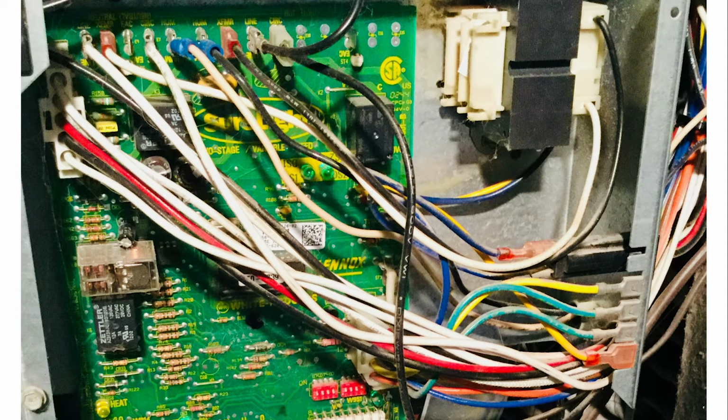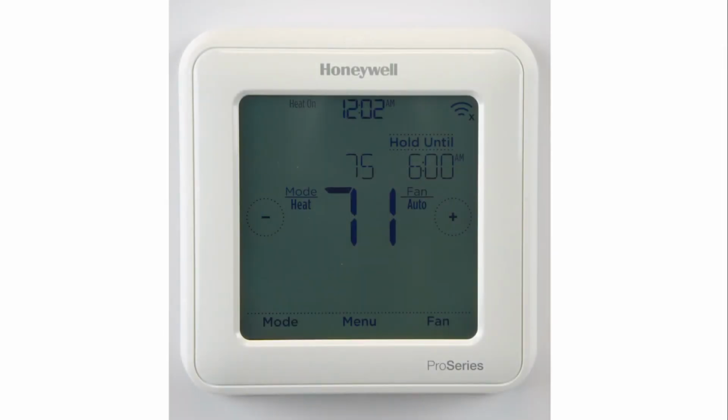If you are experiencing this situation, one suggestion is this. Rather than turn the thermostat off or the temperature down and then restoring either, go to your system, turn off the power, wait 30 seconds, and turn it back on. If your system restarts, it's very possible that the control for it had been locked out, like we mentioned a bit earlier. If this happens on a regular basis, we'd recommend calling your local HVAC contractor and have them find out why the control or ignition keeps locking out.